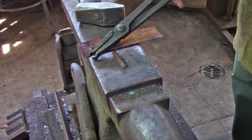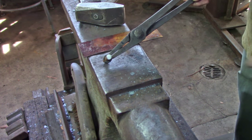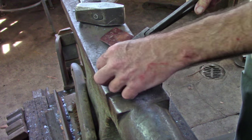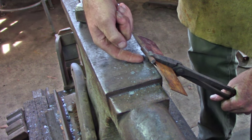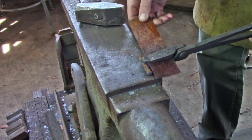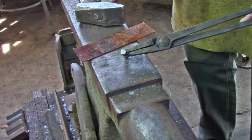As we go into the final adjustment of the jaws, what I would like is for the jaws to grip with a gap back here so that it's not high-centred on the rear of the boss. I'm going to adjust the jaws with a spacer inside and then use the fit and finish, supporting the back of the curve on one side as I hit the other side. Turn it over and do the same. Then I can take the spacer out and I've got a good gap in there and positive grip onto my piece of chain or bar stock.